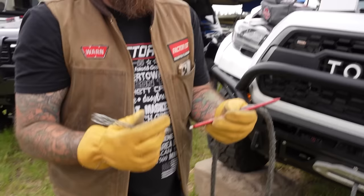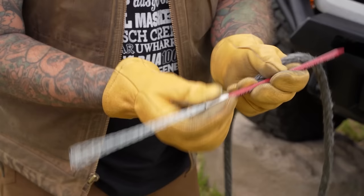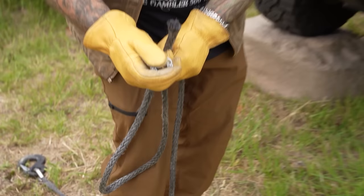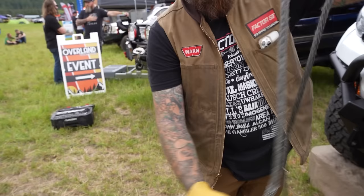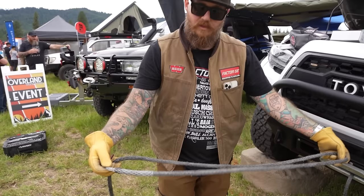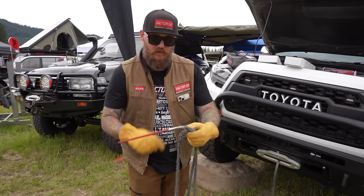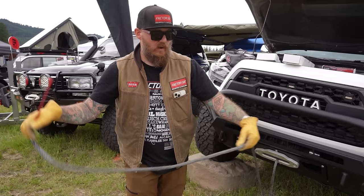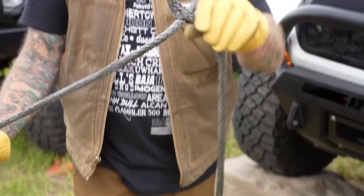The tool comes in the pouch in two pieces. Thread the end on and you've got the wire basket attached — it's like a Chinese finger trap. You expand the wire basket open, grab down onto the end of the rope, and it bites down. Once you measure the bury length, make a little bunch in the line so you know how far the tail has to go. Push the rope together to open up and expose the hollow core at the end of the line, then carefully take the fid needle and go right through the middle section of that rope.